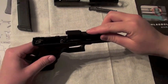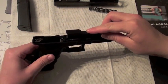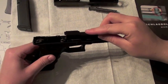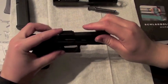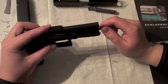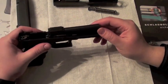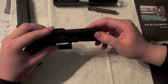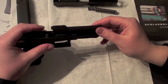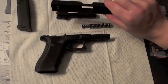You can see the movement of the barrel: there is one millimeter when it goes back, and after that millimeter the barrel goes down and up at the front. The slide can then move back the whole way. When the slide comes forward again, the barrel goes into the locked position and is straight on the grip, and the pistol is ready to shoot.